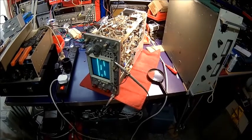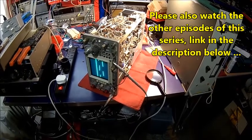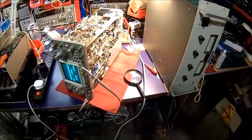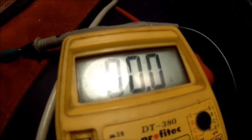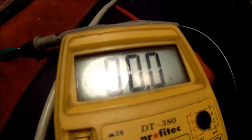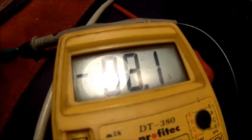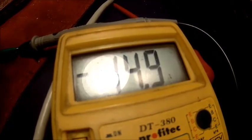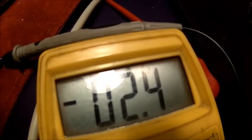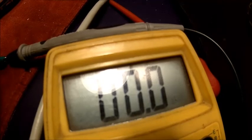The main fault was that faulty part which probably shorted the -8 volt out. Let me double check the -8 volt setting - as expected, the minus 7.9, plus 5, and the minus 15 was minus 22 but that's now pretty good. The meter isn't calibrated so probably better this way. That's plus 50, that's plus 15.